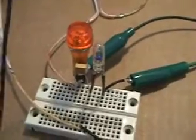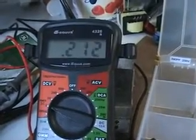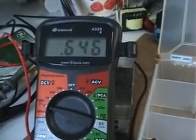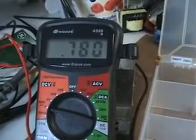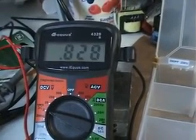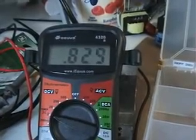I'll insert another capacitance — we're back now. I've inserted a 120 picofarad capacitor and the reading is lower initially. I start tuning the signal generator: going up in frequency it drops, going down it recovers. We were at 0.57 before, but now we're actually able to go higher — 0.828 volts looks to be our highest point.